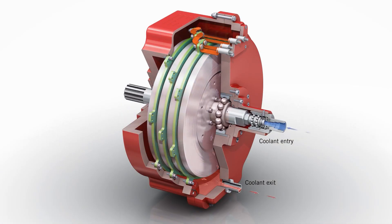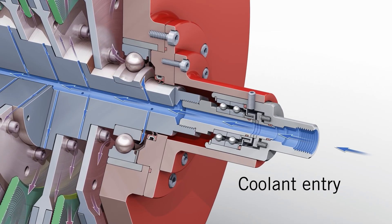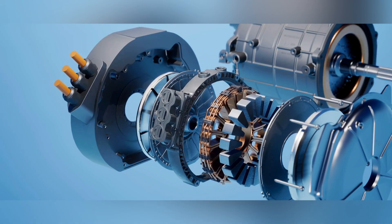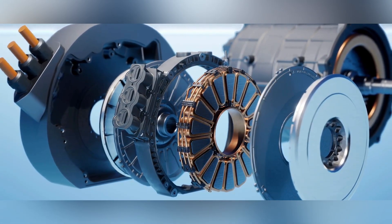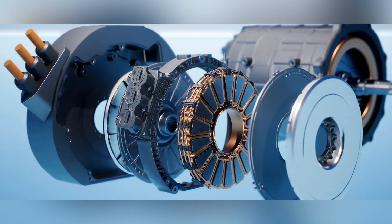Manufacturers are trying to get around this problem by looking at multiple PCB stacking, which in theory would give you higher power density. Axial flux machines typically carry higher power densities compared to radial flux machines just because of their topology, but it also depends on how much money you want to spend. An axial flux copper-wound motor usually depends on an extremely small air gap between the stator and rotor, which can mean bowing or deformation that can completely obliterate the design.